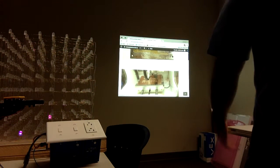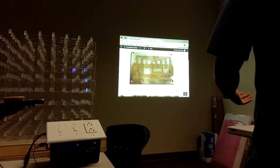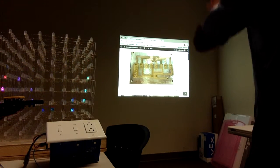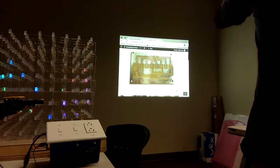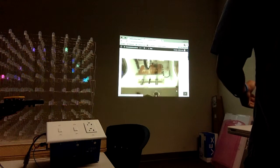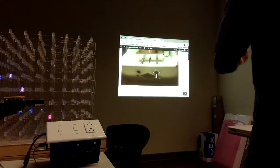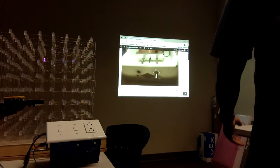This LED cube works in, there's a circuit to it, but this is, I believe, the driver. So LEDs would be hooked up to the power, and then they would be pulled to ground by these power transistors. So there's 8 of them there. My machine's working. Oh, wait, no, it broke. That's not good. I said, crap, plan B.